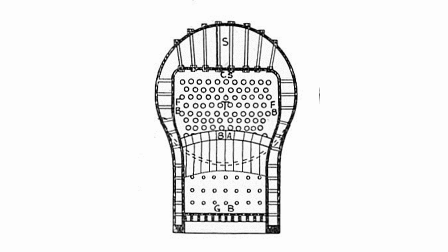The main difficulty of rod stays was that it required a large number of rod stays, each of which was placed at a different angle to its neighbor. The complexity of this rod staying was what drove Alfred Belpaire to develop his Belpaire firebox. This used a more complicated squared-off outer firebox, which was more difficult to manufacture, but could now use simple short rod stays throughout. As for the firebox sides,